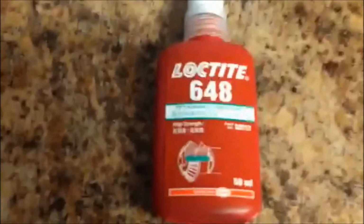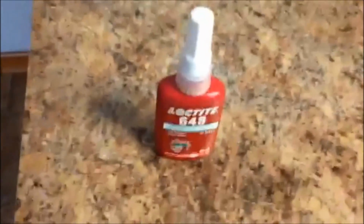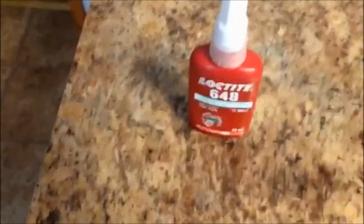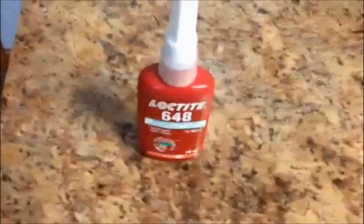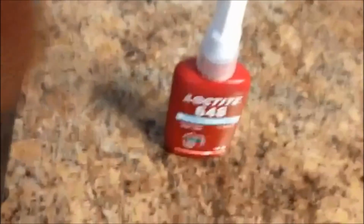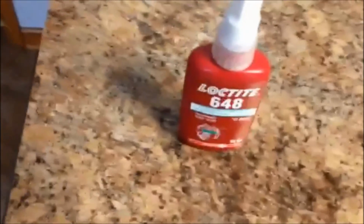This piece of stainless is a little bit bigger than a quarter, five-eighths. And this is going to be the center rod. And my other favorite stuff in the world, Loctite 648. This is bearing retainer compound, basically green Loctite. And this stuff don't come off. I use it for stuff that I'm putting together that I'm not taking apart. Basically, you've seen my brass nuts that are on my truck, such things as that. That's where the 648 comes into play. That way I put it together, I don't worry about it. When I make these hammers, the center shaft will be Loctited. I think I took a video the other day or yesterday of the stainless steel along with a knurling tool and the saw blades. I've got all of them involved here, so they're here.